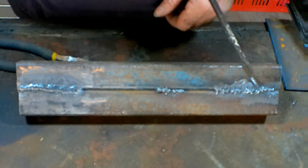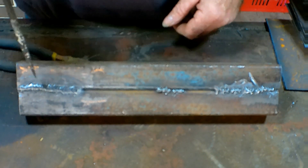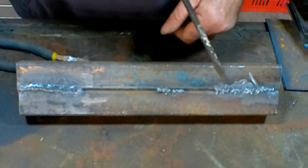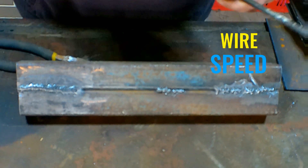As you can see here, there's three different welding attempts. Like I say, it's all done with the same machine, exactly the same settings. It's just that there are different characteristics in the way these things are welded. The first thing I reckon is this here is the wrong wire speed, and it's probably the wrong stick out as well.